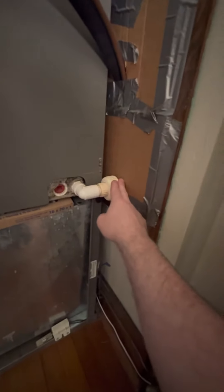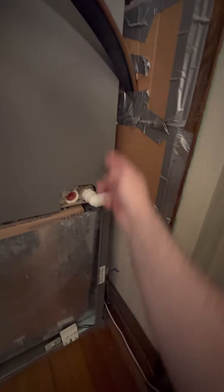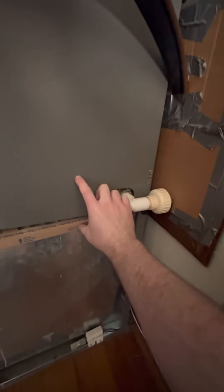Especially since our drain's coming out right here. I think the drain goes through that as well. If you had your five-inch thick filter there, I think that would mess this up. So we'll have to keep this just a one-inch thick filter. And then the thermostat is right here.